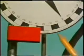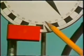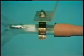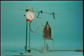It's now expanded as much as it's going to. We must note the new dial reading — it's 34. The brass tubing's now at about 99.3 degrees C. Later, you can work out the coefficient of linear expansion of brass. It's important for engineers especially to know how much different materials expand on heating.